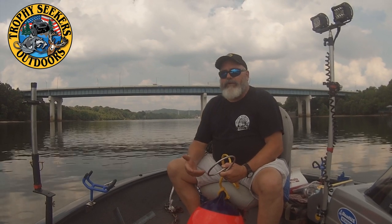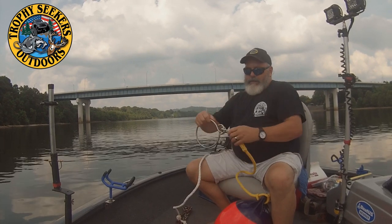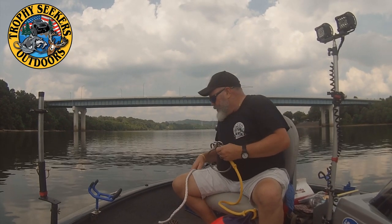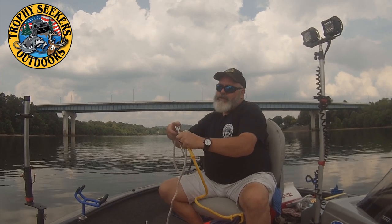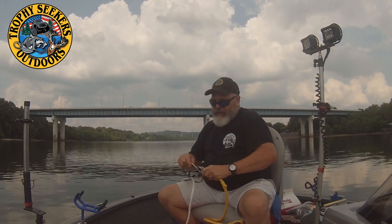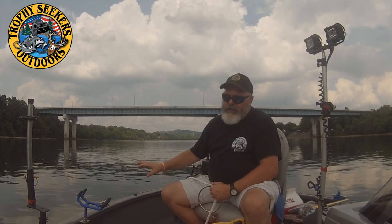Not only that, but for folks that get tired easy — myself, Darrell, Woody — the way the system works is: once you get your anchors out and set up, when you drop your anchor overboard, this anchor ball system has a stainless steel loop with double eyes on it. When you're ready to set your anchor out, you drop the majority of your line out, try to let your anchor hit the bottom, then slide your line through this loop. Once it's through there, you lock it in place. Then you back down to get your anchor to set, and tie off on your cleat.